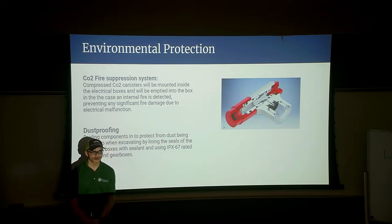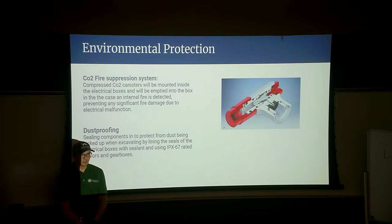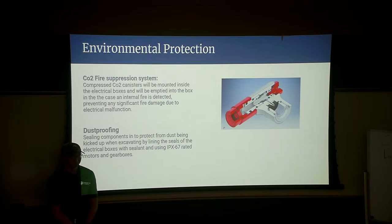Thank you. Yes, Chrissy? I'm not sure exactly how you're putting it in there, but instead of having an entire fire suppression system, would it be easier to detect heat right before fire and have it cut everything off? I have no idea about electrical things, so maybe this is delusional, but could you detect it with a thermocouple, or isn't that what a fuse does? We could put a thermistor sensor in it within the temperature range. They're usually resistance based, and we could probably tie it straight into one of our microcontrollers and have it cut the power before anything lights on fire.